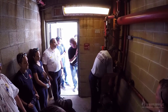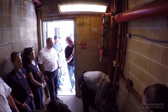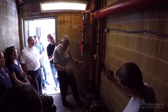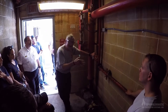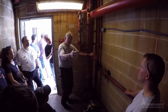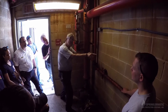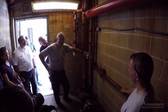We're going to flush this thing. What we did is improvise a Y to a Siamese connection. Someone in the last class asked about using pigtails or a length of 3-inch for evacuation — that's a good idea. Be careful flushing this: if a company is already flowing water and you crank this all the way open, you steal their pressure. Also, if you open this valve before charging the lines, water back-feeds through the pump and drops the pressure. It is absolutely critical to ensure this is not a pressure-reducing valve.